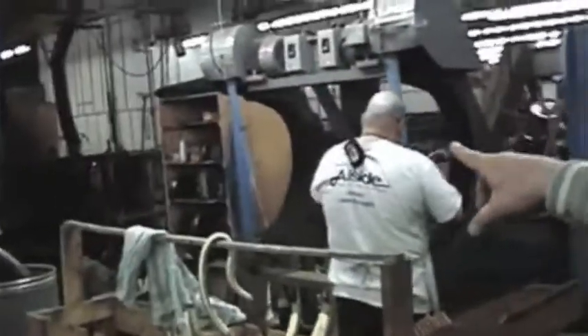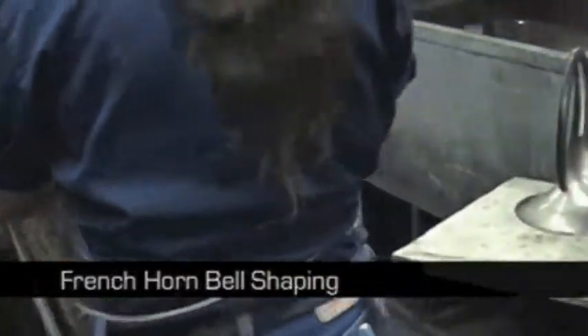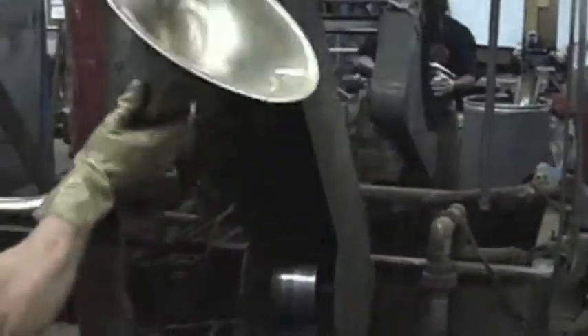There are several different ways to bend tubing. We can do it with sand, we can do it with water, and we can do it with pitch. The large parts will use sand bending. That's my French horn bell bender — that's how it gets so curly. That's awesome.